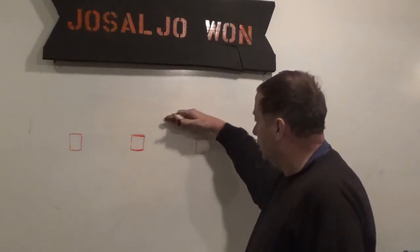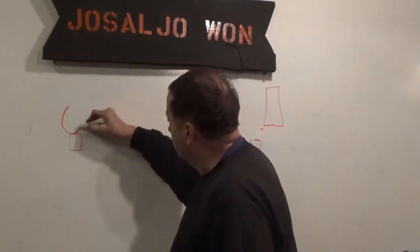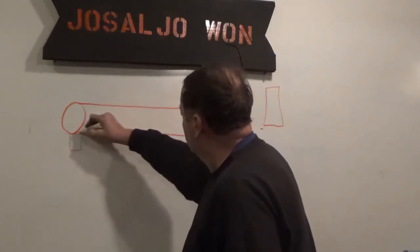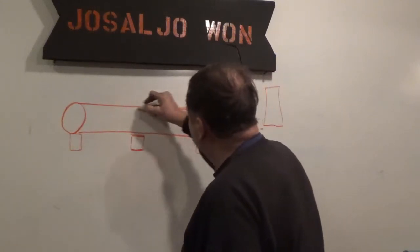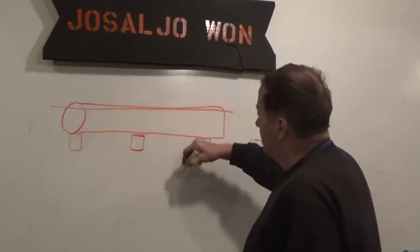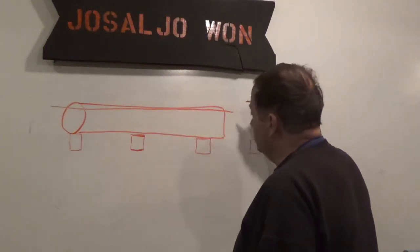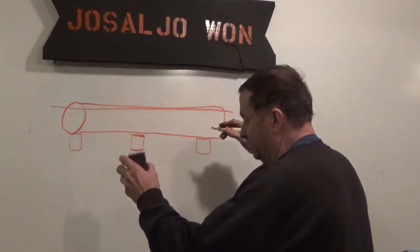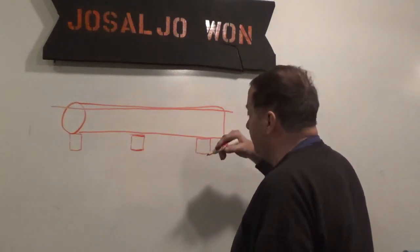If you cut a log, okay, we're going to put a log here. Maybe it's this long only. When you make a cut through here and you flop that over onto the cut, when you make another cut, your log is parallel to one another now. It's starting to be a cant.